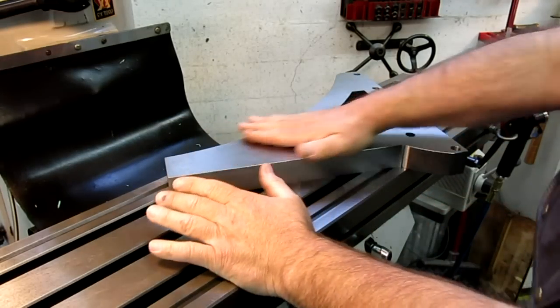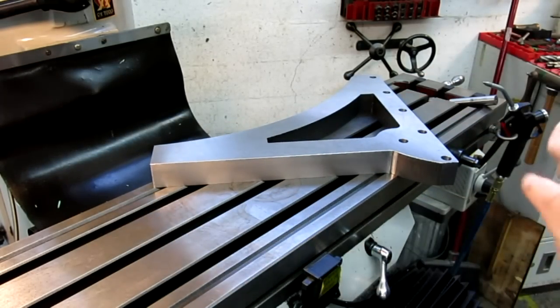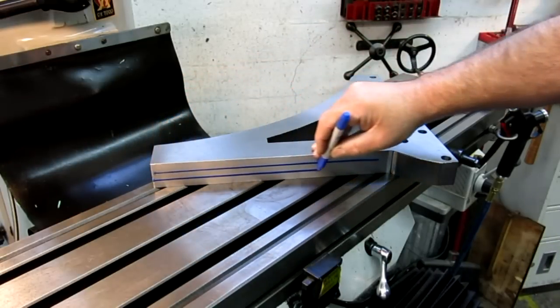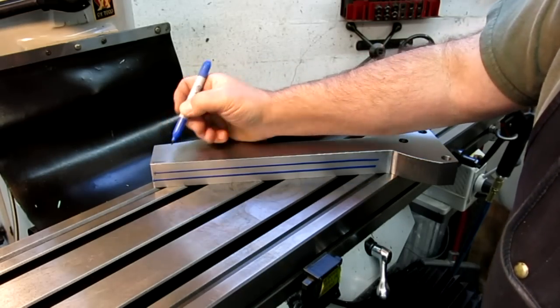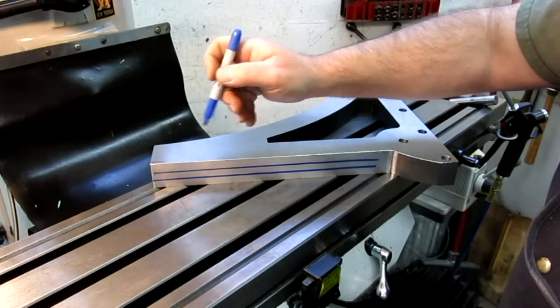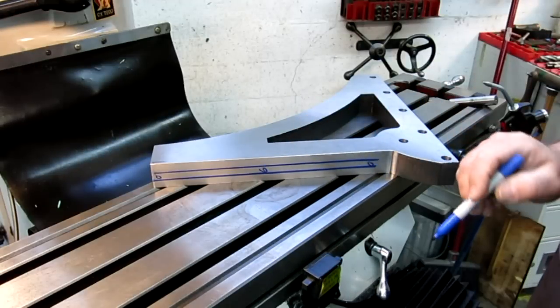So this next setup will be kind of interesting. There's a groove, actually it's a keyway kind of, that gets cut here, like so. Oh, not bad, Tom. And gets cut in a little bit like this, and it retains the bronze key that's actually the slide way for the bearing housing. And then there's some tapped holes that go in here like that, okay?